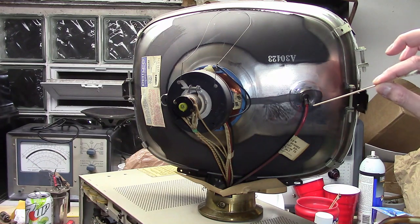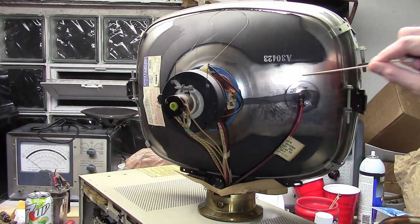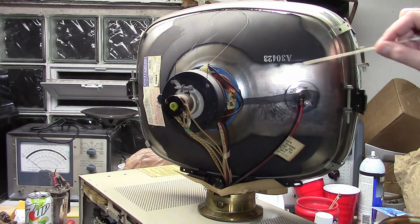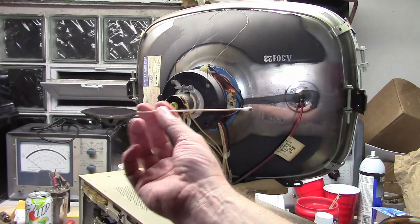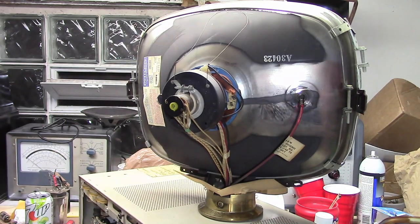What I discovered was there was corona discharge all around here — a little halo about an inch in diameter. There's enough nicotine, tar, whatever buildup on this glass surface, it's providing a conduction path all the way over — about two and a half, three inches. I tried cleaning it with alcohol, going in through the back housing with a long Q-tip. It got a lot better but it's still not perfect. I want to do the job right — this is for a customer, so off it came.